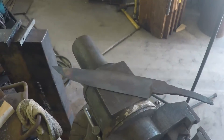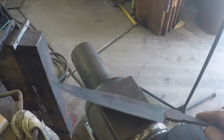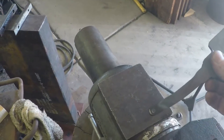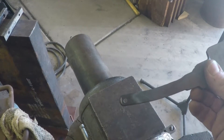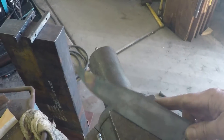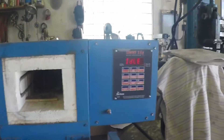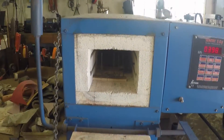We're back. We've put our knife through that final normalization and we're ready to go into the heat-treating. One thing I didn't show you — I did drill a 9/64ths hole in the tang, and we'll show you what that's for. I do that on all my knives. On this knife it has two purposes, which I'll get to in a moment. This is the Paragon heat-treating kiln — it's digitally controlled, and I've got racks in there to hold the knives on edge.